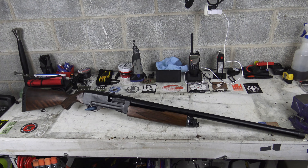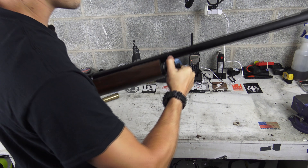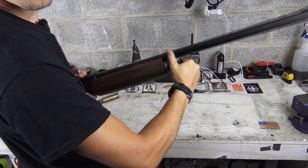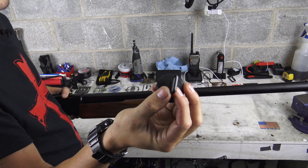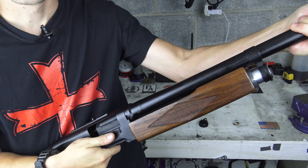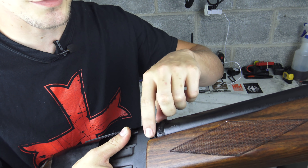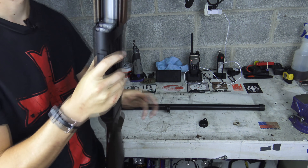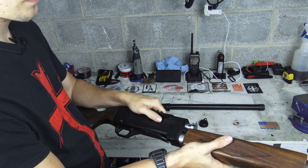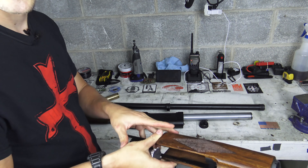The design on these is actually incredibly, incredibly simple, and you'll see what I mean in just a second. To start the breakdown process, we first need to remove the end cap and the magazine tube, which holds the barrel in place via a standard locking ring. It also has your sling swivel there. Once that's off, the barrel with a little bit of encouragement will just pop straight out. The barrel has two little indentations that it fits into — just shoulders there which hold it in place and keep it from rotating. And like most shotguns, it simply pulls forward. The bolt, bolt carrier, and forend all just slide right out.